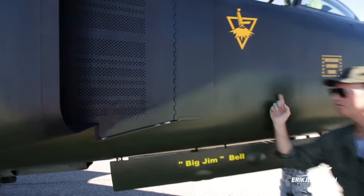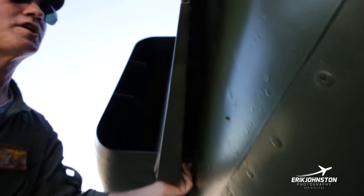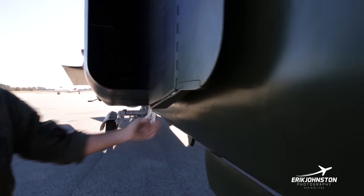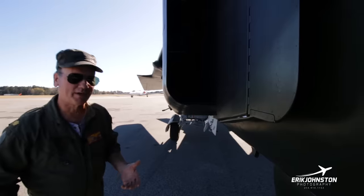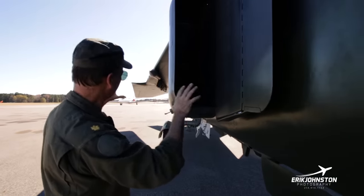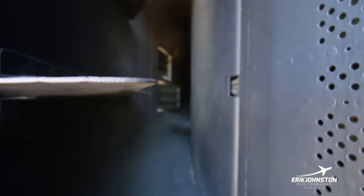On the back side, if you want to come around and look between the fuselage and this ramp here, you'll see these splitter vanes, very sharp objects. And they were designed to cut the barricade when the aircraft would land aboard an aircraft carrier. Of course, this aircraft never did, but the F-4 Phantom did. Story goes, they reverse engineered it so well, they didn't know what they were for, they just knew they wanted them exactly like it. So if the Phantom was to take a barricade, it wants the nose to go through the nylon mesh, and this would cut the barricade so it would trap the wing. It would let the nose go through, but you want the webbing to catch the wings. So once again, they designed it exactly like the Phantom. They weren't sure why, but they did it anyway.